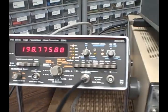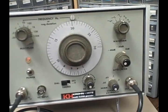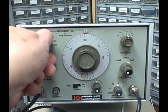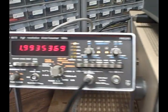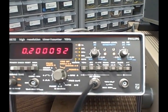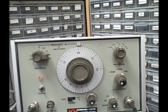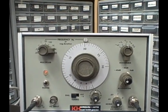On the 200k range we're reading 198.8. On the 1 hertz range — I've got a dial of 20 so we should get 20 hertz — we have 20.24. On the 0.1 hertz range, times 20 would be 2 hertz and we're getting 1.99. After a several second wait, our counter came in to 0.2000. I'm not even going to attempt the 0.001 hertz range; it would just take too long. But the unit excels at producing low frequency signals.